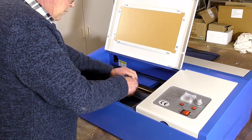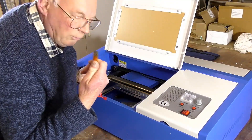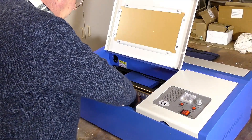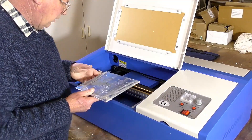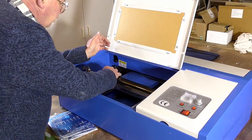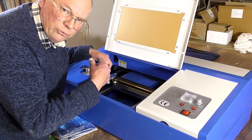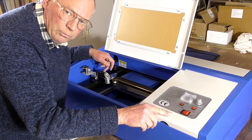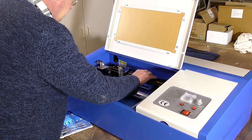What we've got here — if you're not going to use the program, you don't need this. This is the key for the program. This is the bed that actually covers the work area. When you move the gantry or the head, move it slowly. Don't grab hold of it and yank it. These stepper motors, as they turn around, act as generators and can send power back to the board. You can actually burn something out on the board. So when you move it, just slowly and steadily.